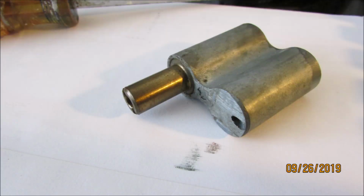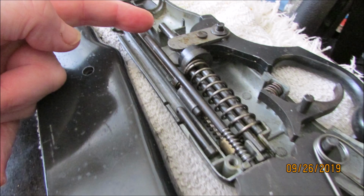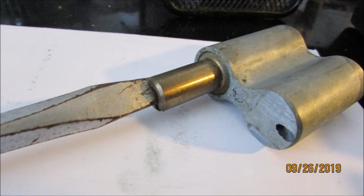Yeah, this time anyway, we'll start off with redoing the valve. So let's go. And here's what the valve looks like. 1965 stuff. It brings the gas in on the bottom and puts it out on the top. And it fits in that open spot there, right towards the front of the mechanism. Right where I'm pointing. That's where the valve fits in, and the little rod against my finger goes in there, where I'm putting the screwdriver to remove it.